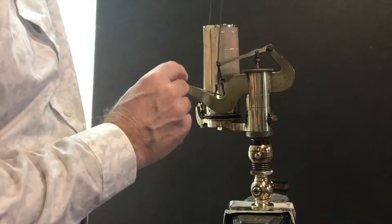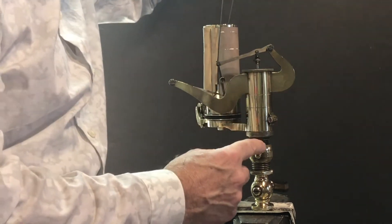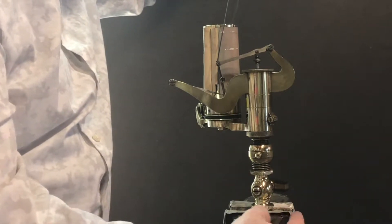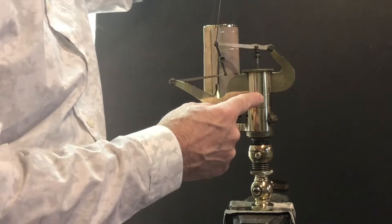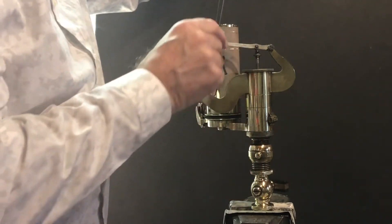This section has a pin on it and is connected to a piston and cylinder in here. This is connected to the cylinder of the steam engine, so the pressure inside the cylinder comes up through here and pushes a little piston up against a spring, which essentially measures the pressure — the higher the pressure, the higher the pen rises.